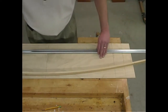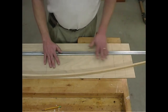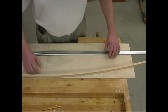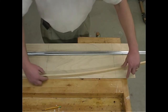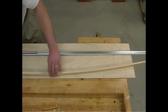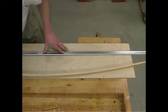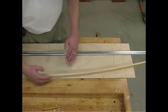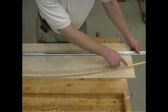I'm using a larger bow than my normal one — it's a thin strip of wood between a bar clamp. I can draw tension or compress the clamp to increase or decrease the curve. I want the curve to line up with the point 2½ inches in from the edge and blend smoothly back at the 23-inch mark. Opening the clamp decreases the curve; tightening brings it out. The midpoint of the bow's length is at the critical point, giving us a nice tangent blend. I've got it just about right with just a little more adjustment before drawing the line.